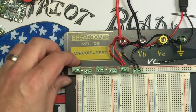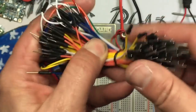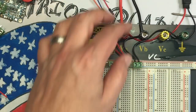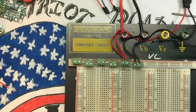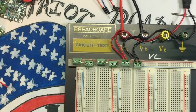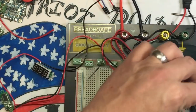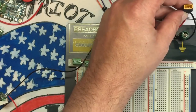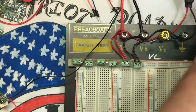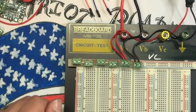All good. So, yeah, the next thing we're going to do is, you see these little Arduino pins, we call them, or breadboard pins, okay? Male to male, these are the patch cables that go into everything. So I'm going to take a few of these and cut them. I'm going to wipe this off, okay? And I'm going to double-sided tape a voltmeter here, a voltmeter here, and a voltmeter here. But for right now, we'll just do this top one. I will not be plugging in an XT60 and, excuse me, an XT30 at the same time. I just did this because sometimes I run 2S micro stuff and then everything else, or 3 or 4S micro stuff, whatever. So that's that.